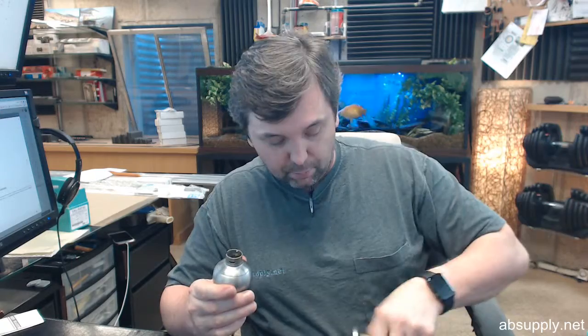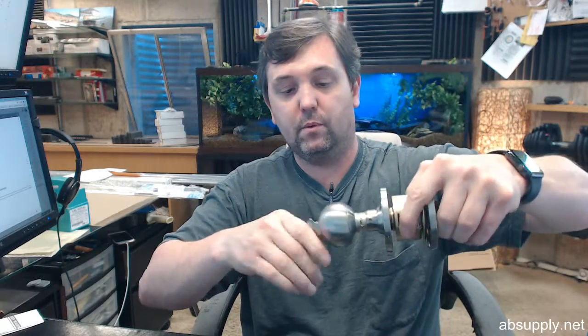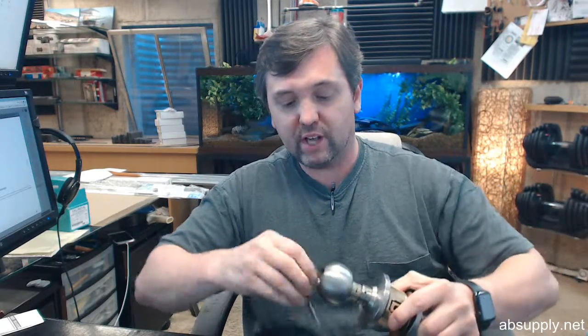That'll snap down. Hold that tailpiece down to control where the cylinder is, and then I like to insert the key into there. Then, depending on the hand of the door, I will put that with the teeth up either this way or this way. You're going to want to push that down as far as you'll go. You'll have to jimmy the key a little bit because it will rock the tailpiece into the slotted receptacle inside the lock housing. And once you get that down, it will not go any further because the inner part of the knob stem will be hitting the projected tab.